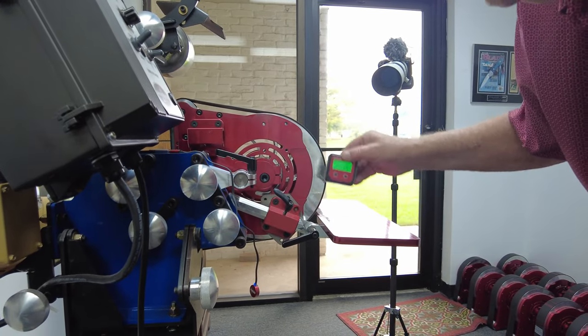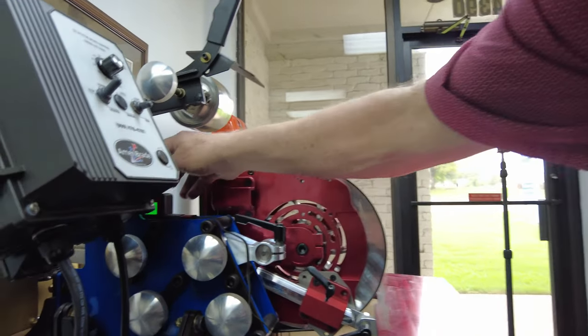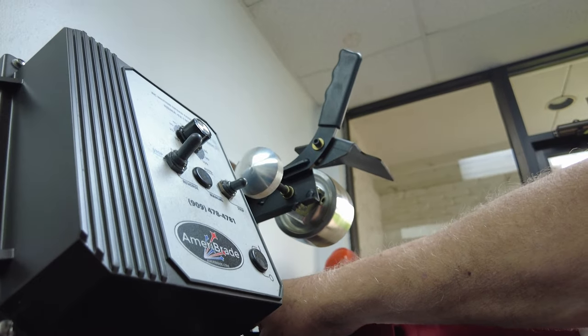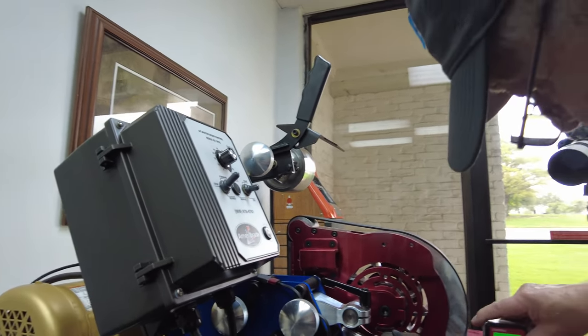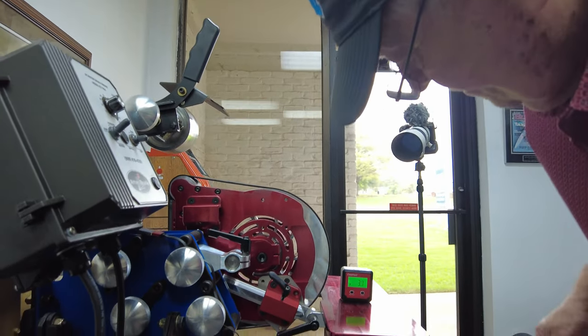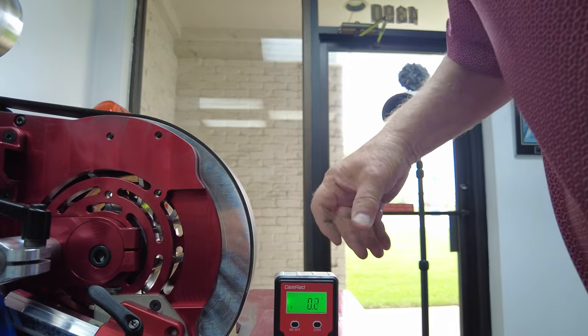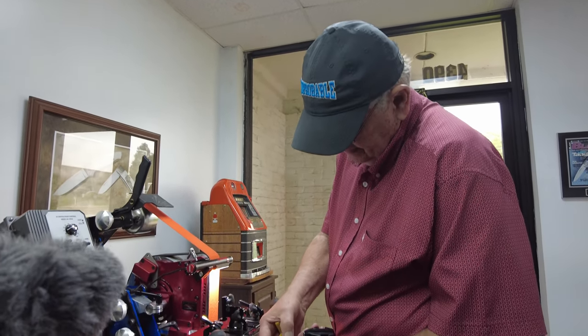Reference point: let's go up here at the back of this and zero it where you have a flat surface on that arm. I've got it done. Now I want this 90 degrees, so it'll have to be zeroed like I just zeroed the other. That's close enough. I mark the center line of the blade that I'm going to grind.